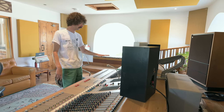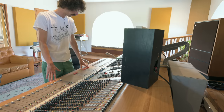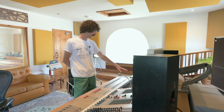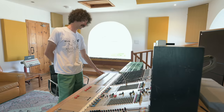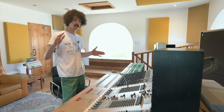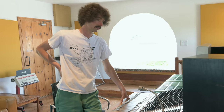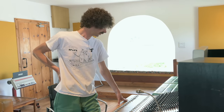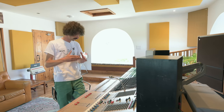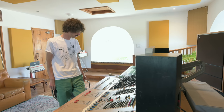It's got a range of channels - mono input channels, dual input channels, some stereo channels, and eight groups. The first eight preamps have been modified to be transformer balanced by Chris Roberts, with Lundahl transformers, where the J-type is traditionally a transformless console. I would describe it as open in terms of high-end and low-end. I just feel like the octaves go down and down as well as up. It's pretty flat but it just goes on. It's quite a big sound.